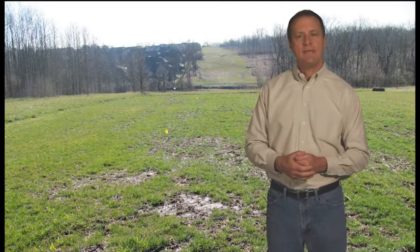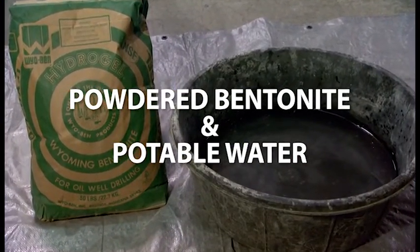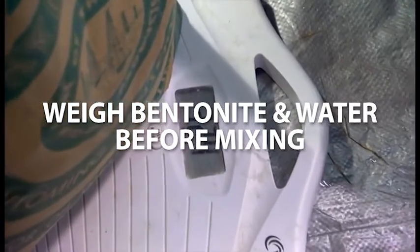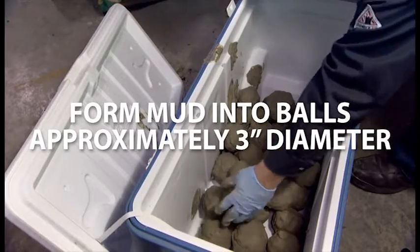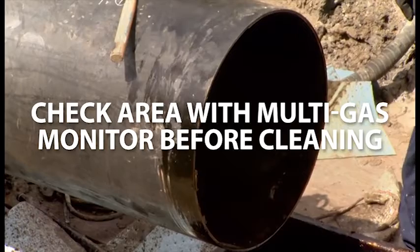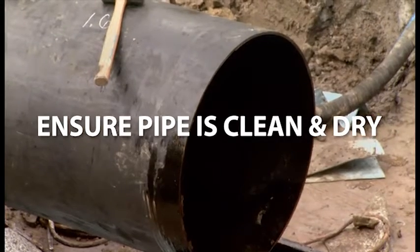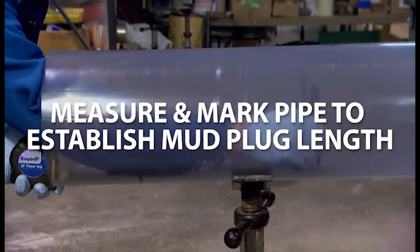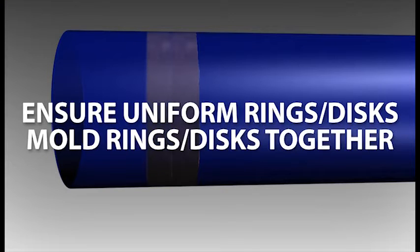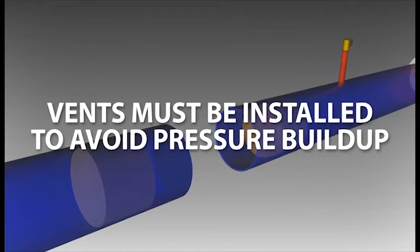The following are some of the valuable points that need to be emphasized in mixing and constructing mud plugs. API-grade powdered bentonite and potable water should be used to create the mud mixture. Weigh the bentonite in water to ensure the mud has good processing characteristics. For best processing characteristics, add the bentonite powder to the water. Form the mud into balls approximately 3 inches in diameter. Check the atmosphere inside the pipe and surrounding area for flammable and other harmful vapors with a multi-gas monitor prior to cleaning the inside of the pipe. Make sure the inside of the pipe is clean and dry prior to installing the mud plug. Mark the beginning and end point of the mud plug to establish the desired length. Ensure each series of rings or discs are constructed uniformly and all subsequent rings or discs are molded together to create a solid mud plug. Ensure vents are installed to avoid pressure buildup that could cause the mud plug to be ejected if the pipe should become pressurized.